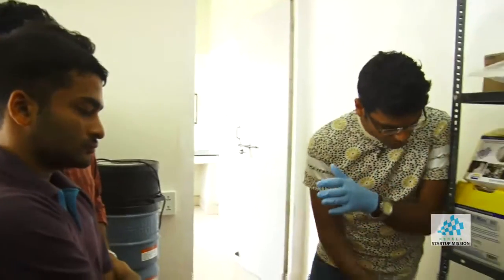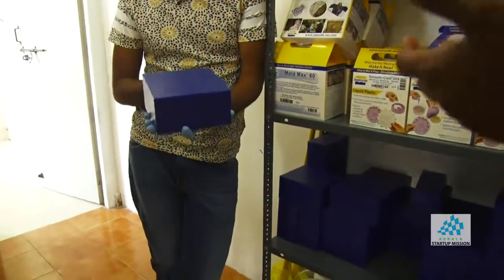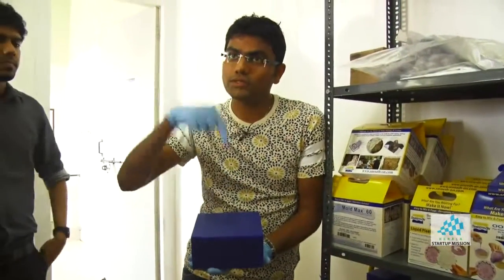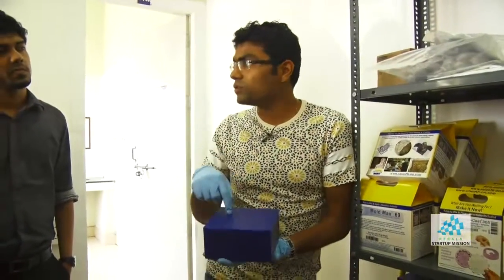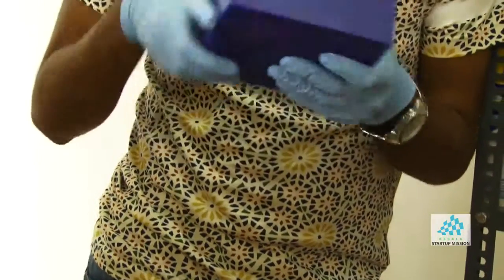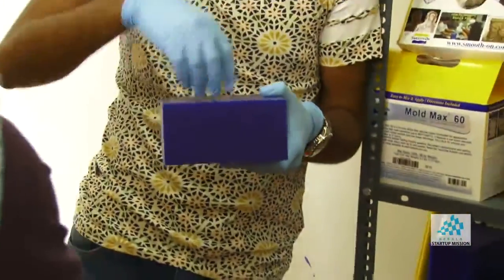So what you will do is take a block, put it in the base, and then use the glue gun to actually stick it. And then you can use that. Now that has a small bit, and it's going to do it at very slow speed. So that will make sure that the wax is not melting. So this is mainly for Roland Modella. I did it for Shopbot because you guys were using it, so I just wanted to.